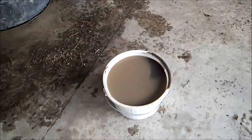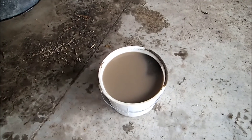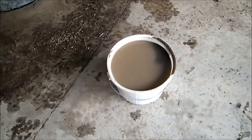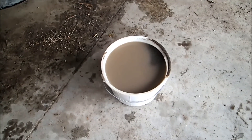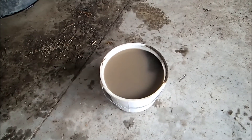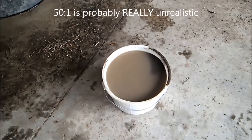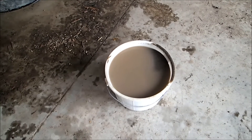It's obvious that there wasn't any improvement in that, so I'm not sure where to go from here. Running dirty sand — and this batch was almost all sand — we should have gotten a little more sand through and we did, but it looks like it pretty consistently is doing about a 6 to 1 reduction. I would have liked to have seen something on the order of 50 to 1, and maybe that's unrealistic. I don't have any experience running jigs for gold.